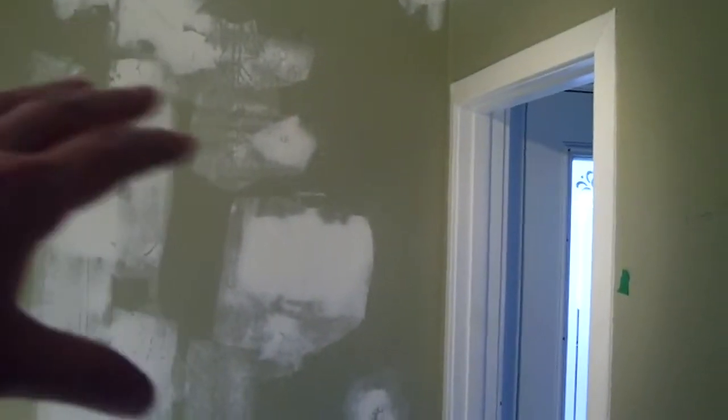I've been doing some more muddying, and I've got to plaster these two spots again one more time, especially the top one, maybe not so much the bottom one. I'm not going to see them anyway, but they look pretty good now. Got a lot of patchwork done on the house there, because a lot of that wall was all wrinkly. The paint on it was really wrinkly, so what I'm trying to do is put some plaster around where the wrinkles are to try and smooth it out so when you paint it, it doesn't look so bad. I've got one more spot right here that I should do over, because when I run my fingers across, it's pretty lumpy there.